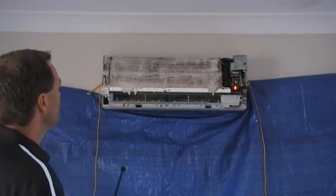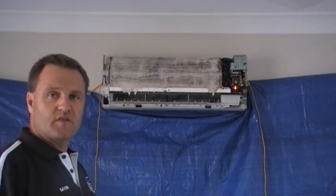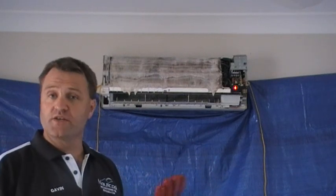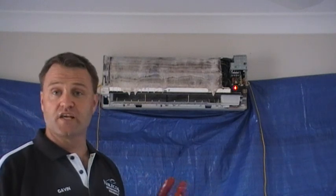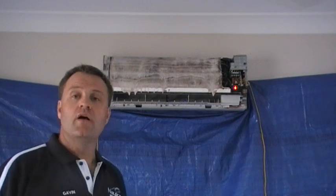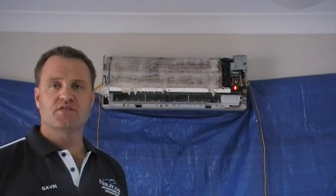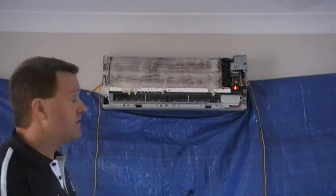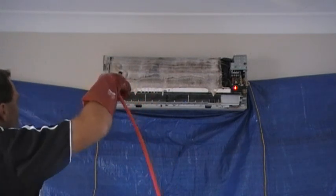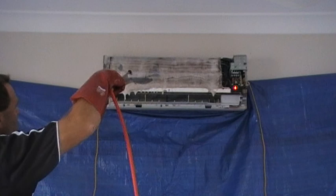Now, I can see that the foam has stopped growing, which tells me the chemical reaction has finished doing what it's doing, all the alkaline's basically eating as much rubbish as it can, and now we're going to wash it off. By the way, this process may need to be repeated more than once, depending on the dirtiness of the coil. We find that a lot of resorts and things like that, their air conditioners are basically turned on 24/7, and they build up such an amount that they need a few treatments to actually get them back to a bright, shiny aluminium. But our next step is to flush